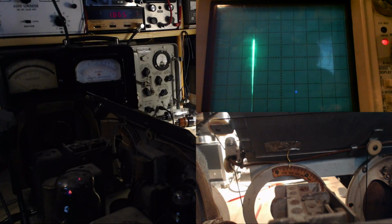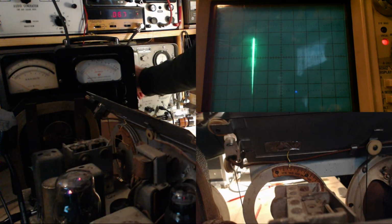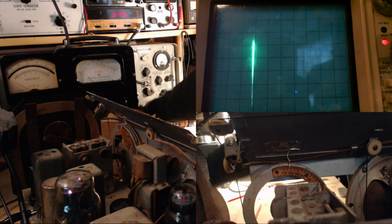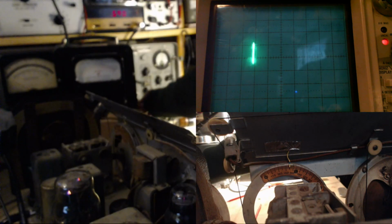What we'll do is we've got the radio tuned down around 600. We'll fire a 600 signal at it. Yeah, there we are. So we're at 550 right now. And we want to take it to 640, where there's actually 590, which is a better station. So this is 590. Tune it in. There it is. There should be a station right here. Get the signal generator out of the way.